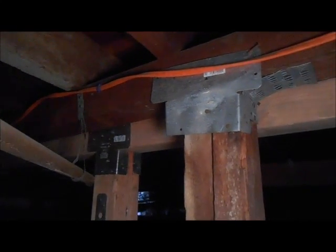It's a very old home. And the way they did it before was, all the 4x's are rotted out. And they used a 2x4 and a 4x4 for the beam. And this one's spanning, I don't know, probably 10 feet. And you can see that we have 2 concrete piers and a bigger beam. So it was way overspanned.